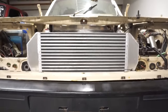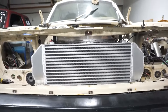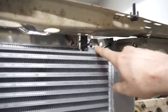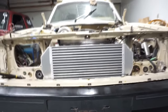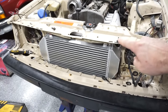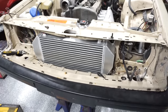I got this hanging there but I don't really like it — I think I'm going to have to redo some parts of it. I kind of eyeballed it and measured where I needed to put them, drew some lines, and then welded those tabs on. But one is a little bit higher, and when I fully bolt this thing up you can see there's a little gap and it's crooked — it just looks a little funky. I'm going to pull the whole thing out. I'll leave one tab on as a reference point because I'm okay with where that one is, but I want to fix the rest of it and get the radiator and intercooler level with each other.